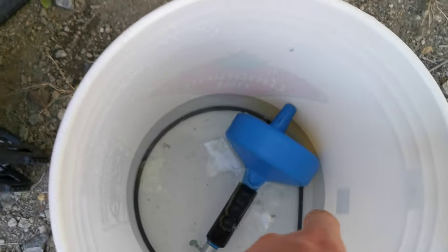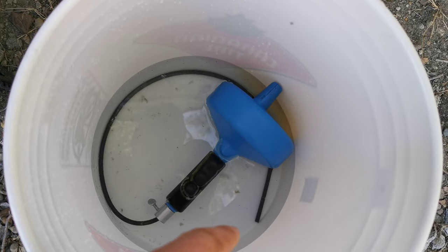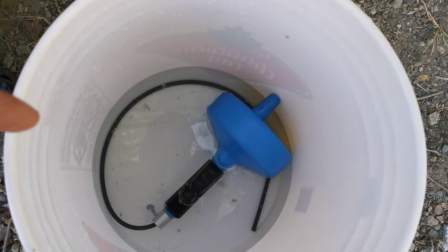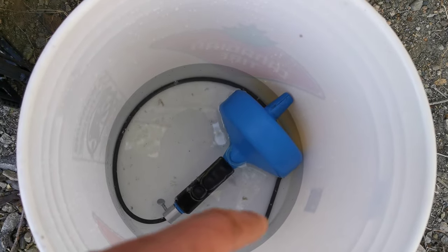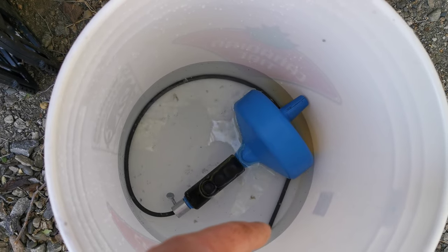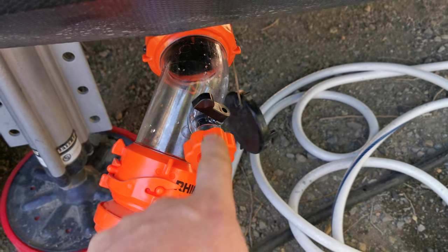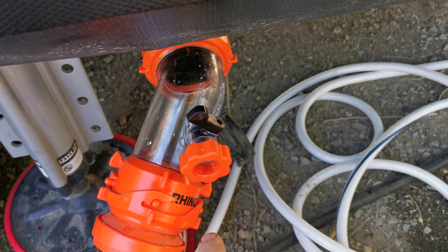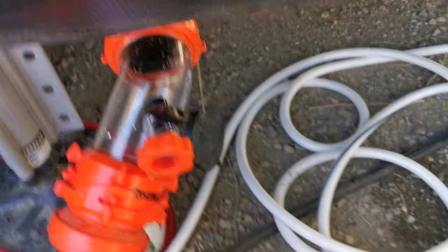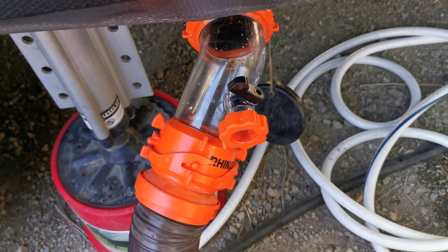Buy yourself an auger. They usually have a big coiled tip — take it all the way out of the auger, then reverse-feed it in so the tail end is actually what you're feeding in. It'll fit perfectly. Just squeeze it in and keep going — it's going to take a while. Have someone feeding while someone else is turning and it'll slowly work in.